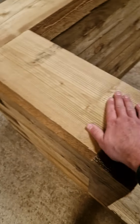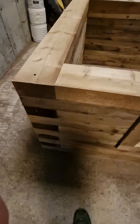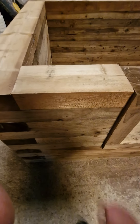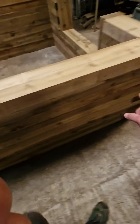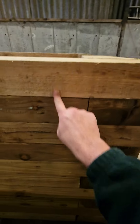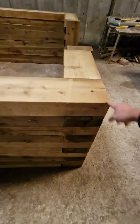We've only put one screw in for now because we don't want to be properly bolting everything down yet — if you keep screwing and unscrewing into the same hole it'll weaken it. For this small corner piece that isn't connecting other bits of wood, you do two either side — four in total. For this longer side piece connecting two different pieces of wood, you do two at each connection point.